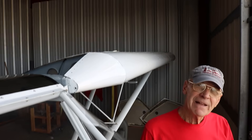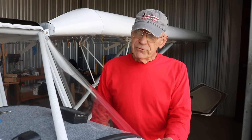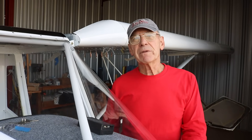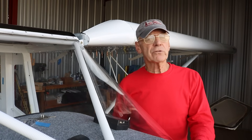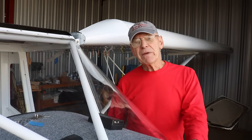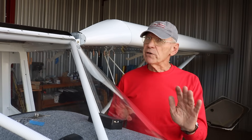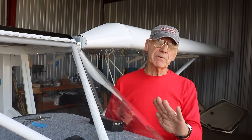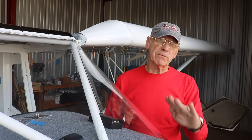In exchange for that, any consideration of doing VGs — whether glued or riveted to the top of the wing? The consensus of opinion is to put the VGs on it — keeps the air energized over it. But I've talked to other builders who built it without slats, put VGs on, then took the VGs off and said they didn't notice a difference. You're not flying at the same high angle of attack — you're more on the wing. It's just a different flying airplane.